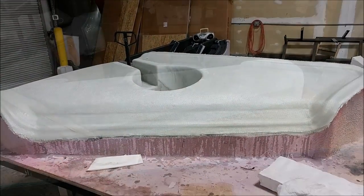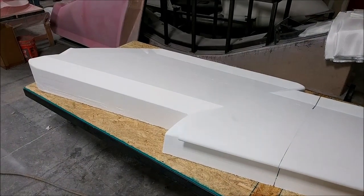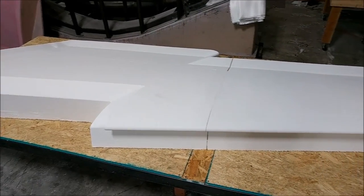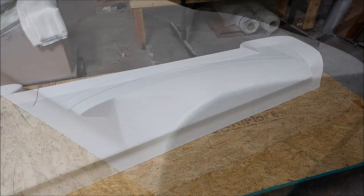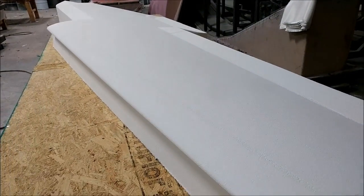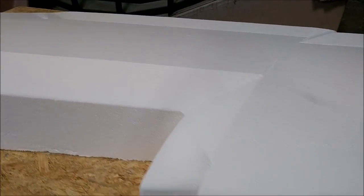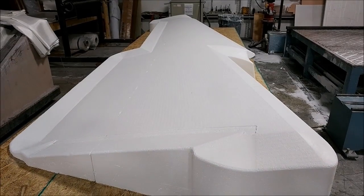Here's the left side upper wing skin plug all finished now. Didn't get a lot of video of it while it was underway, but basically had it running overnight and finished it off this morning. Here it is all prepped and ready to have the fiberglass laid over it, in order to get its putty and then get back on the machine. That one came out really nicely — every time you do the second one of something it comes out better than the first, and I didn't make a big hole in the platform this time, which was good.